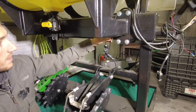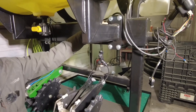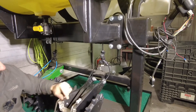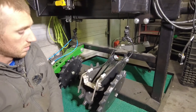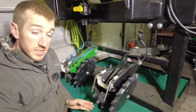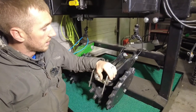So that is how we do our splitting. Come back off the red balls with a single line — that's quarter inch — go into the top, come down to the quarter inch caps, and come out here to a three-eighths to quarter connector to lock onto that stainless steel tube of the totally tubular. That'll give you a true 50/50 split right down here.